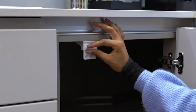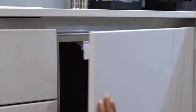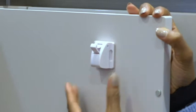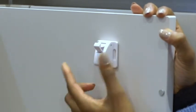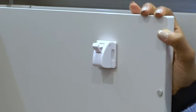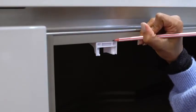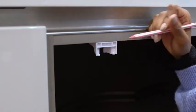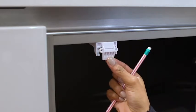Remove the film from the back of the lock, close the door fully, then reopen — your lock is now stuck in the correct position. Firmly press down on the lock to improve connection, but be careful not to move it. Draw two faint pencil mark lines parallel to the two small lines on the inside of the applicator. This will accurately allow you to align the catch to the lock.